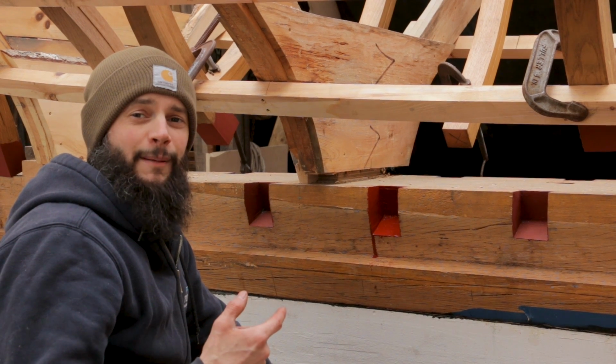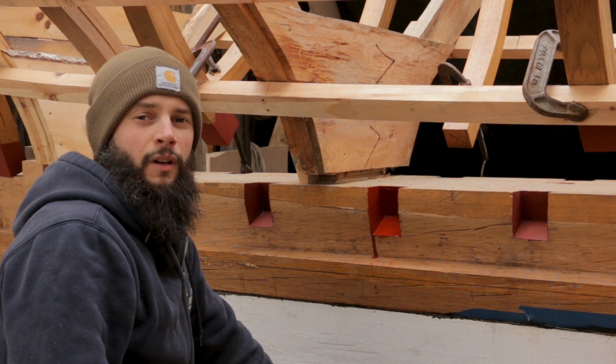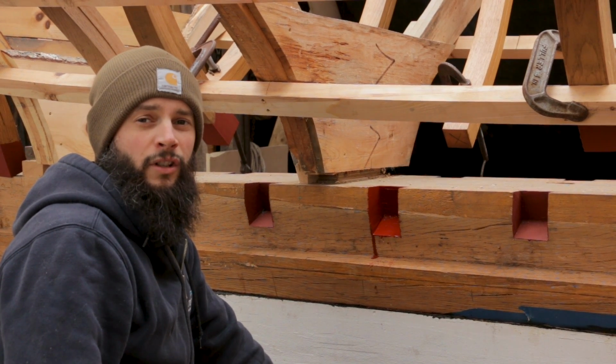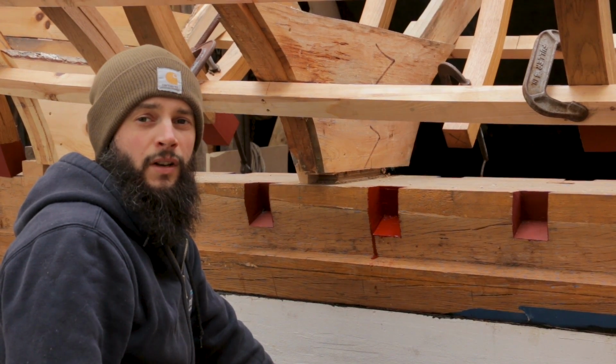And now that we've killed a little time doing this, the coats of shellac on the frame upstairs are dry, so we can grab the sander and give the rest of the frame a little bit of a sand, and sand off any of the shellac that got places we don't want the shellac, and that frame will be ready for the Danish teak sealer.